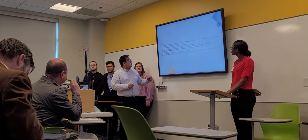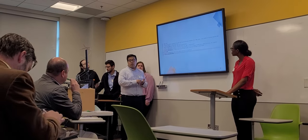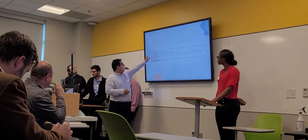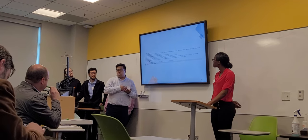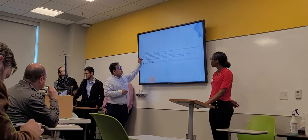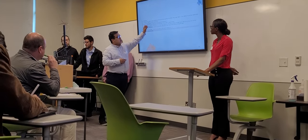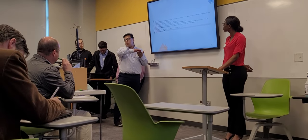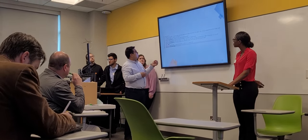Basically, this code is going to be repeated throughout the whole process, depending on which speed the actuator selects. So, for example, this digital read is going to check if a value of 1 or 0 has been sent to the board. If it's a value of 1, then it's going to move on to the next line. This is going to activate the direction pin, and it's going to send a value of 1 or a value of 0. A value of 1 is going to be 5 volts directed to the pin, or 0 volts, which is just off in case it's not connected.